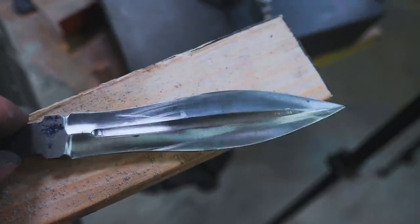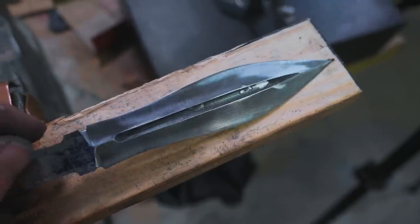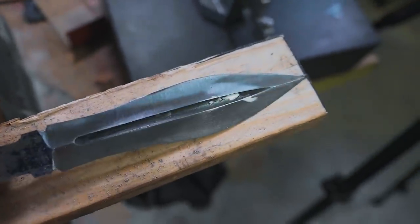We've made some good progress on the hand sanding. I have one fuller started to get hand sanded pretty well, but the other one is just filled with scale. In my normal fashion, I left it in the oven too long for a normalizing cycle. So I'm going to run upstairs and see if using our micromotor and some rubberized abrasives, a little more diligently with a little more time and effort, we'll get that scale out so that we can hand sand it all up.